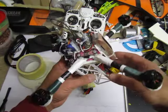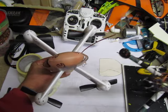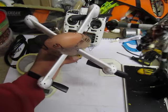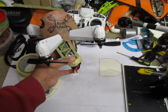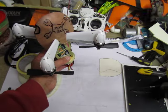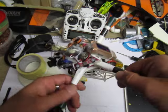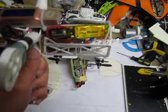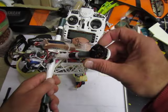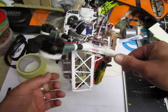The first thing: this thing is heavy — it's a 250 size. This one is very light; well, not very, but it's considered lightweight. It's only 200 size. When I built it, I could actually build it even smaller because I started building it before I had the motors, since it was built for 5-inch props max. But I can only use 4-inch props on this one. The flaw of this one is that it's very heavy — something like 800 grams. There are heavy ESCs; the bigger motors need bigger ESCs. I resoldered the caps and there's a GPS logger on board — heavy stuff.